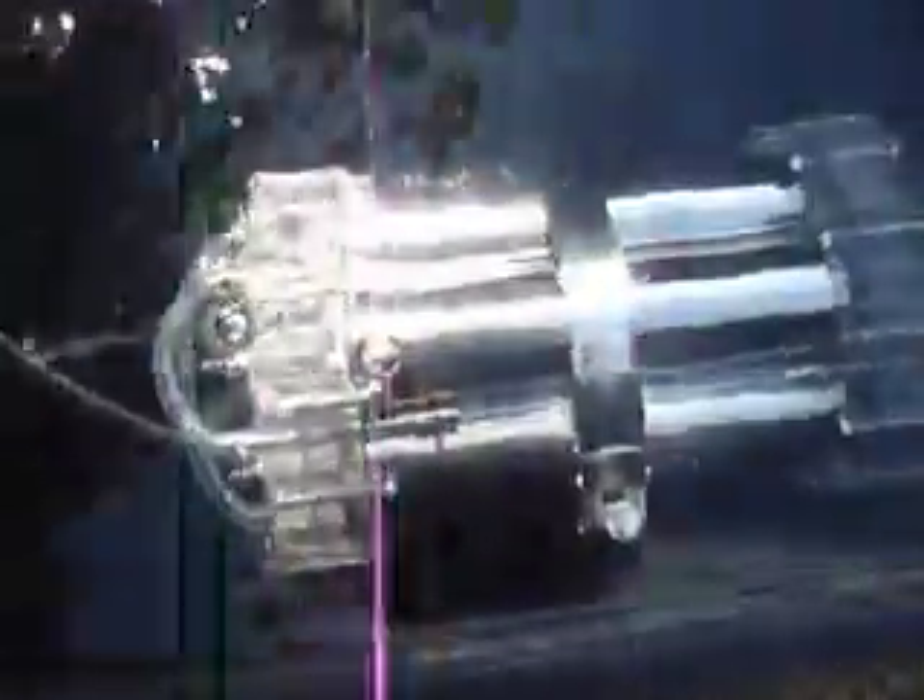This system here has got a ring ground into the tubes, and there's stainless steel lock wire compressing the hose onto the fitting. I've lock-wired all the tubes in that fashion for safety.